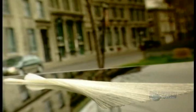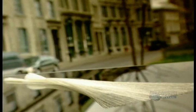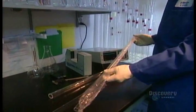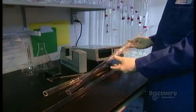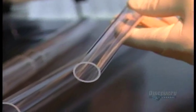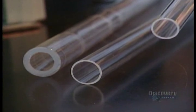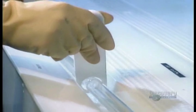The process of transmitting voice or data via pulses of light through hair-thin glass fibers begins with large glass tubes. First, workers unwrap the tubes. Then they submerge them in a corrosive bath of hydrofluoric acid, which removes any oil residues.